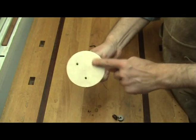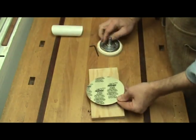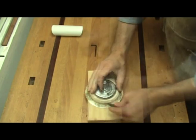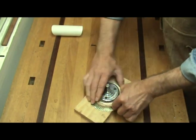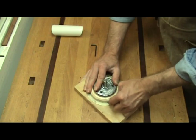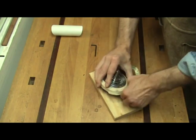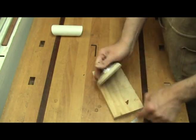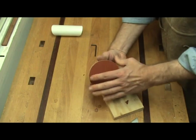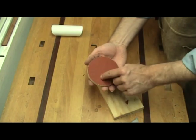The next thing is to apply some sandpaper to the bottom of the disc. You can use adhesive sandpaper — just peel off the backing and stick it onto the sanding disc, then trim it flush with a razor blade. If you don't have sticky-back sandpaper, use spray adhesive on the disc and stick a regular piece of sandpaper to that. You might also want to seal the back of the disc with shellac before applying spray adhesive.